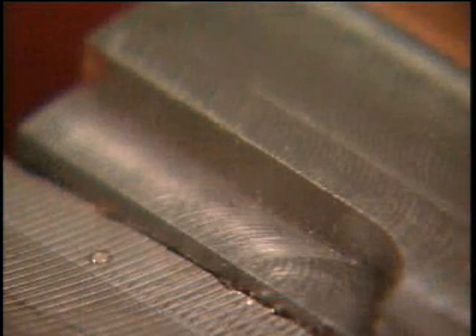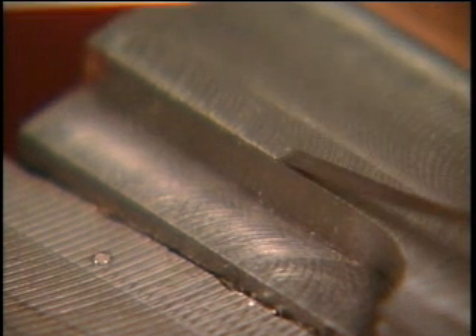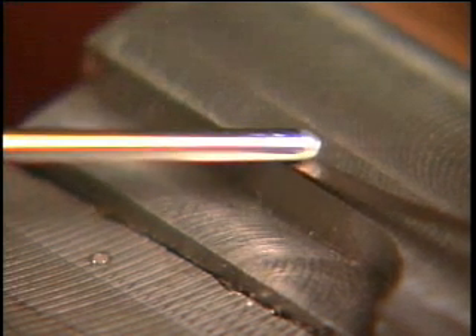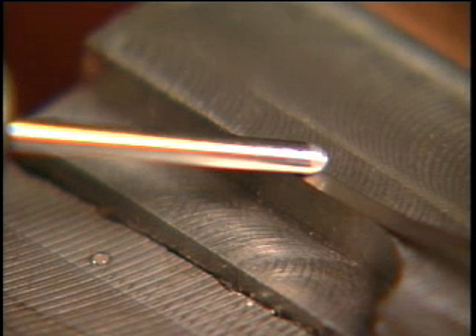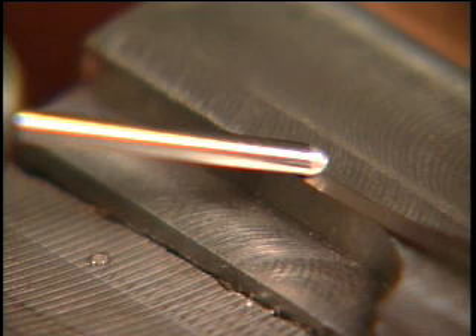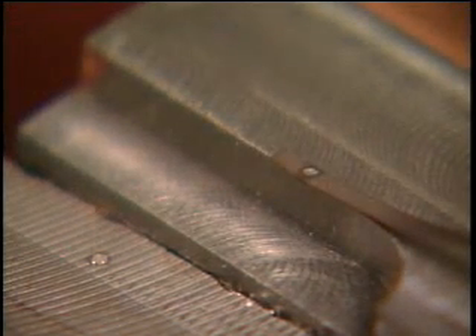I will be doing an example of a repair on a mold parting line of a plastic injection mold using ribbon material — this is a very common application. The ribbon material may be trimmed if desired or used directly from the spool. Start by positioning the repair material so that approximately one-third of its width is hanging over the edge of the parting line. The material can be tacked down at various places along its width, aligning it using the free end.